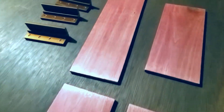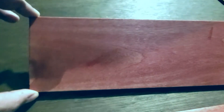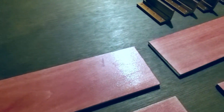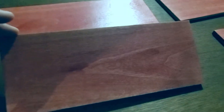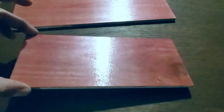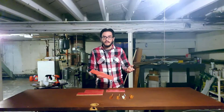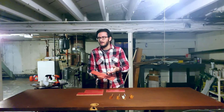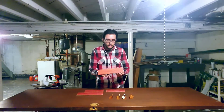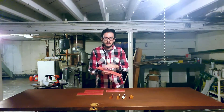The wood is just a poplar board you can buy at Walmart or Home Depot for like four or five bucks. It's three and a half by a quarter inch and four feet long, so I got all my pieces plus a spare side. Poplar doesn't normally look like this — it's colored with a mixture of craft paint, pretty much imperial red and some brown mixed with water, painted on in two or three layers, then sanded down because the grain raised and got really rough.